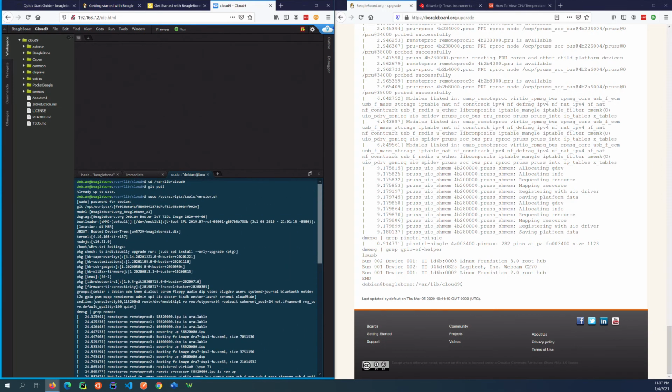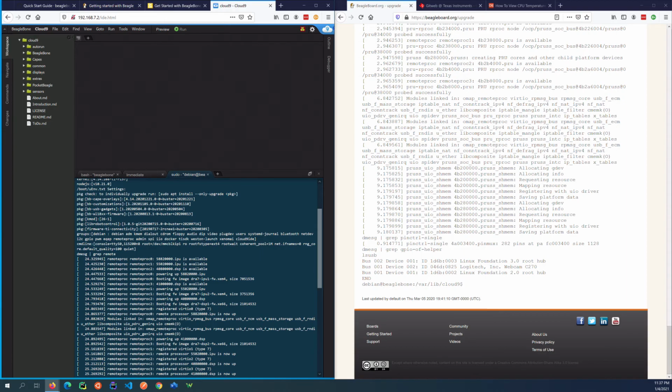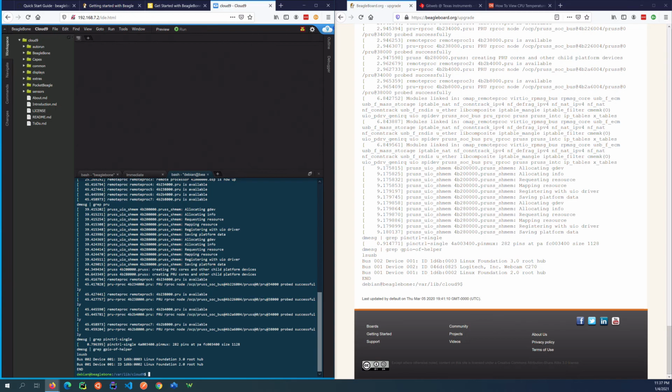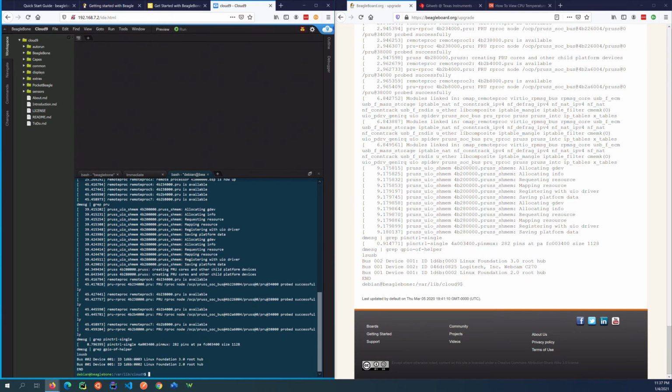What is this doing? Buster IoT TIDL. So I guess this is a Debian Buster Internet of Things TI Deep Learning image. April 2020. Just reading through what it's trying to do. Let's try to make sure that everything's there. Maybe it would throw an error if something was wrong. This looks right. So yeah, looks like we have a fully updated board, and I can turn the temperature sensor back on and lay it back down flat and see if it overheats again. That'd be an interesting thing to check.